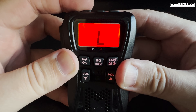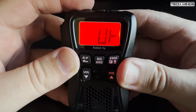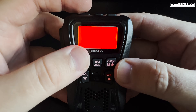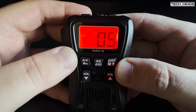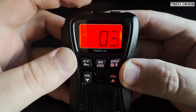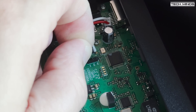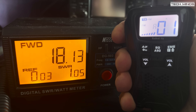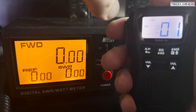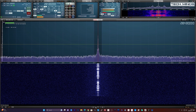This little radio can be put into what we call export mode, which enables two main features. The first is changing the channel bands to letters A through N, plus a dedicated bank of channels for the UK 27.81 band, essentially allowing the radio to transmit on AM and FM between around 25 up to 30 MHz including the 10-meter ham band. The second feature is enabling the RF output to be set in three levels, with the maximum at around 15 watts. To activate export mode, simply remove the top cover and move the jumper from position 1-2 to 2-3, then power back on. As you can see, we do get around 15 watts on the high power setting, even a little more on some bands.